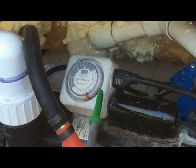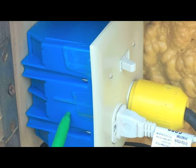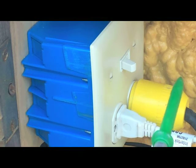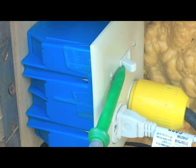Just a basic timer to control the external filter — nothing very special here, just a plastic box. The relay is housed inside here. I have 110 volts for the transformer, and then this one here is going to that timer I showed you earlier to control the external filter. And this is the override switch for the circulator pump for the boiler.